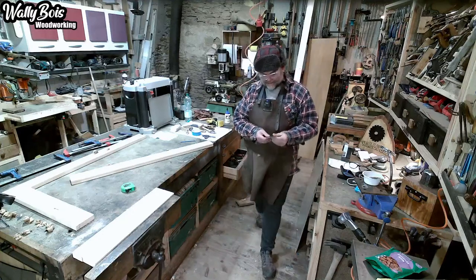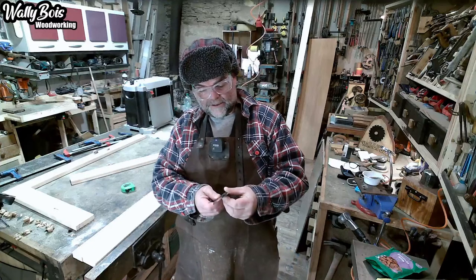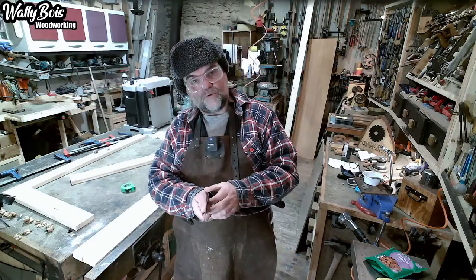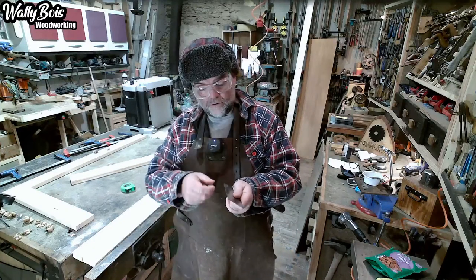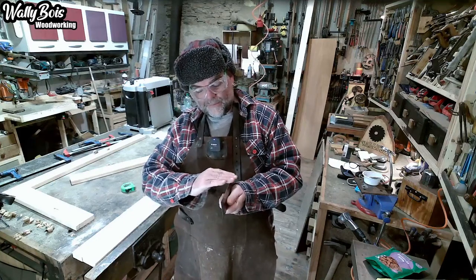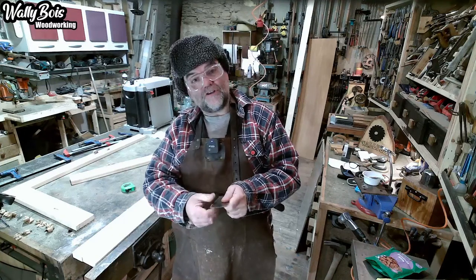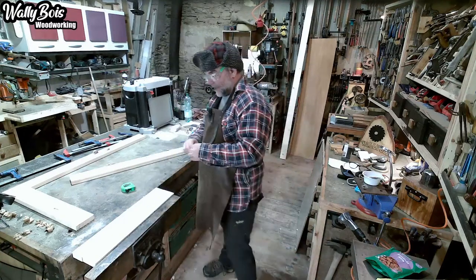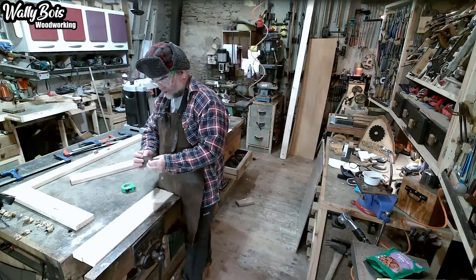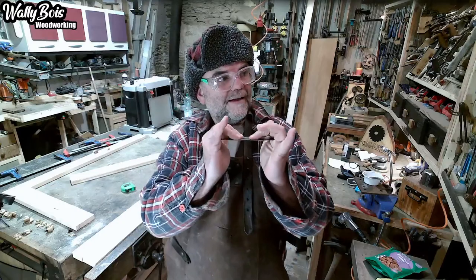Basically, it's actually sharp. It's just a square piece of sprung steel, and it has an edge. And you create that edge with another round steel, by basically polishing the edge 90 degrees perpendicular to the side, and that creates a burr. It's the burr that is the cutting edge. And how you use it is you hold it like so, and you bend it like that.